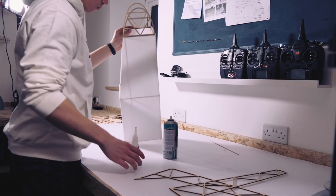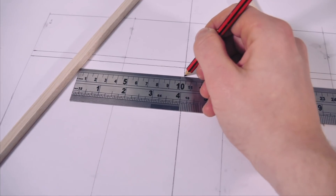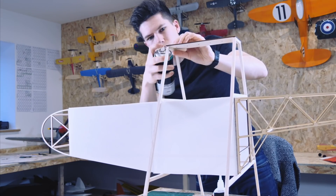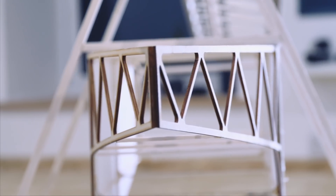248 grams for all of that wood right there. I also decided to go with a full helicopter-style fuselage with a super-rigid A-frame-type landing gear built around it. Although this was mainly for looks — because let's be frank, I wanted to build something that actually resembled a helicopter this time — I felt having a box below the rotors would also be useful for building a control system, which is something that I'll talk about in a minute.